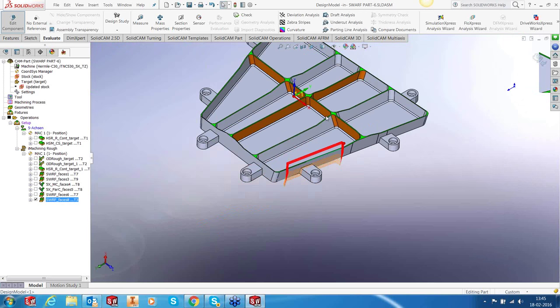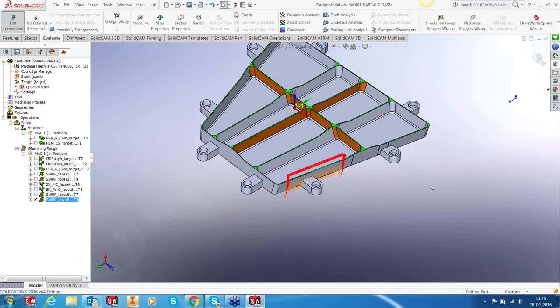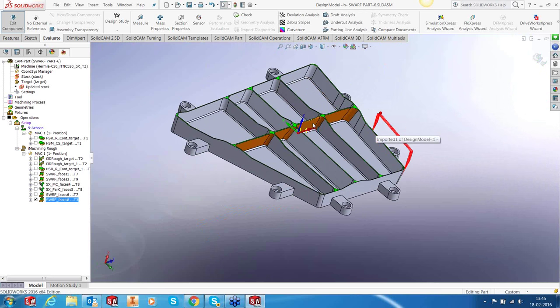And how is this done? Basically, when they're cutting off the lugs, when the part is done, they put soft clamps on three or four places and machine the lugs out. The screws are removed and then the lugs are just smoothly shaved out from the part. And then the part comes out, ready to move on to the further process.